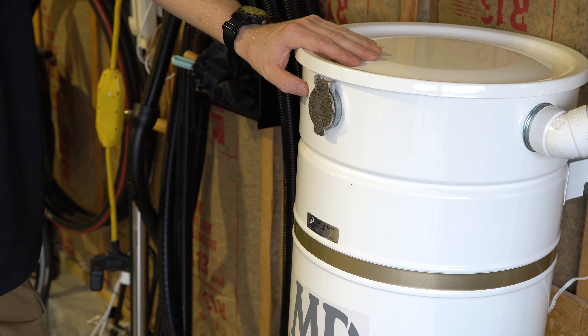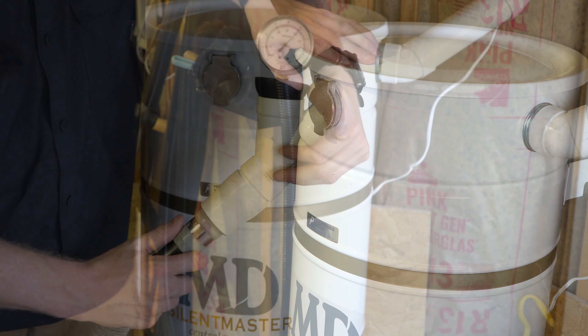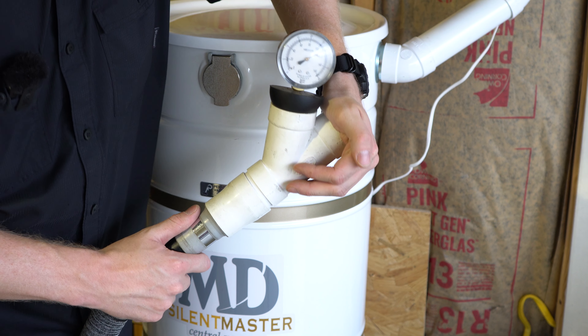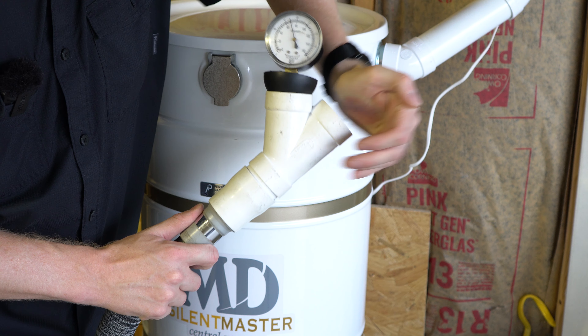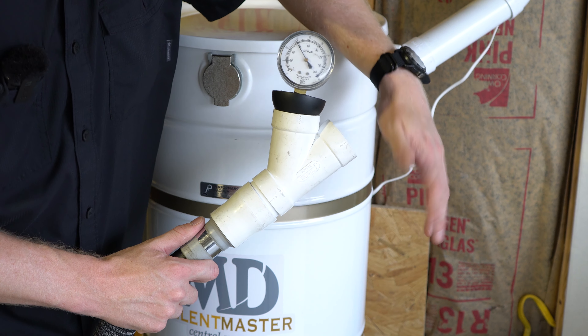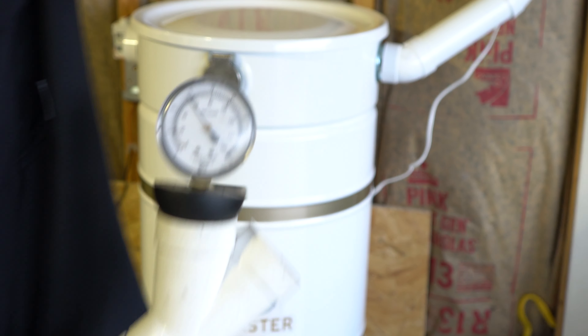In my particular installation, this is not the ideal unit — this is an example of oversizing too much. What I believe is going on is that these motors can't actually spin up properly because it's too restricted through the retractable hose. That could cause motor problems potentially in the future. I have seen that before in installations.